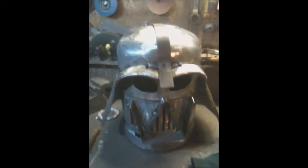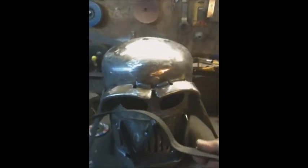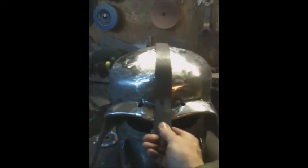Okay, I've got my band cut. I've very, very roughly bashed it to shape. Not too hard to do, it's very malleable, very pliable, this. What I really try to get is a reasonable fit in here. The rest of it, I know you can see through that gap, absolutely massive. Once this here has been tacked in and the heat starts travelling over, it's tack and bash, tack and bash, tack and bash, and it will be a nice fit.